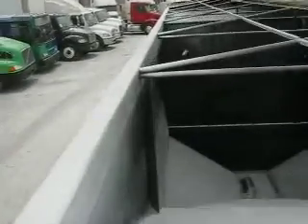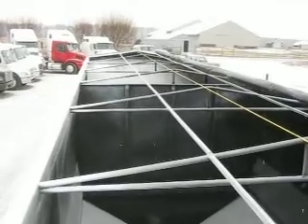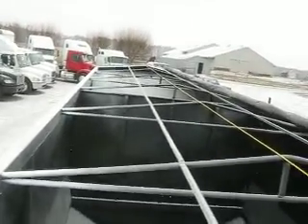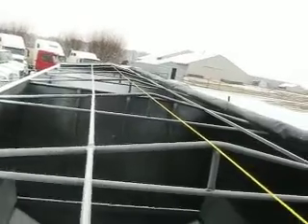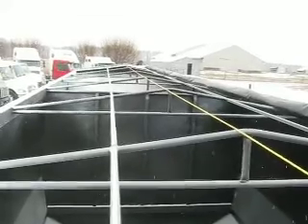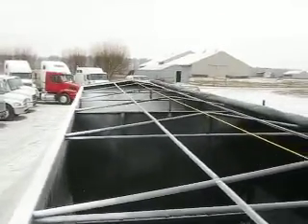We have a little snow on everything, so we're going to go slow and be careful. Now as I come up on top, folks, you can see what I was telling you — you're looking in the back hole of the hopper. There's the full center divider, and then you can see further up we have the front compartment. However, there's no space between the doors — you can dump it from one stop. Each compartment will hold approximately 450 to 480 bushels, and if you heap it up you can get a thousand bushels of corn on it. Take a look at the tarp bow structure, folks — they're built like a truss in your building system. They are not just a hoop to hold up your tarp; they play a major factor in the strength of the trailer, holding the side rails perfectly straight with each other.